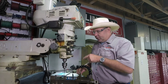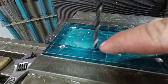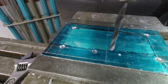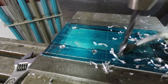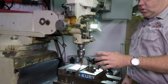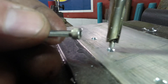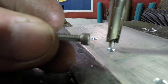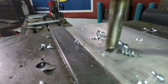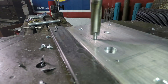Our little mount — we're going to drill the holes in the base. It's pretty straightforward. I've already laid them out on the layout lines and center punched them. Because they're on the same plane, we'll just use the travel on the mill to keep them perfectly lined up. The part is flipped over and here are our two holes that are going to hold that little mount we made. We need to put a counter bore in there because we're using socket head cap screws and they can't hang out the bottom — it wouldn't sit flat. So we're going to bore about a quarter inch counter bore using this counter bore tool, and I'll mark my depth stop on the mill.